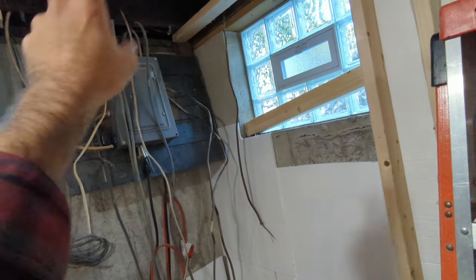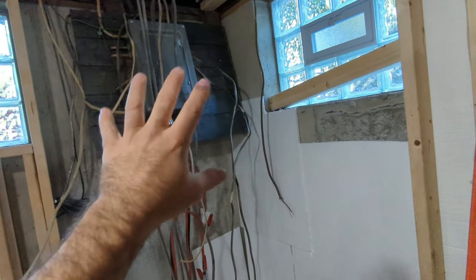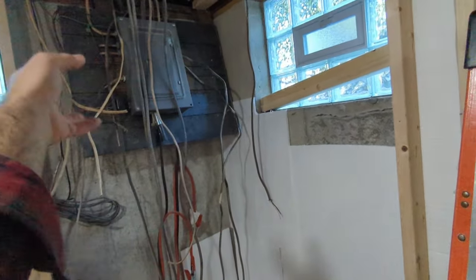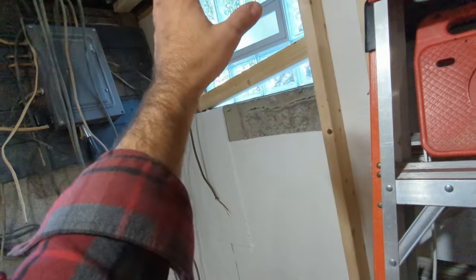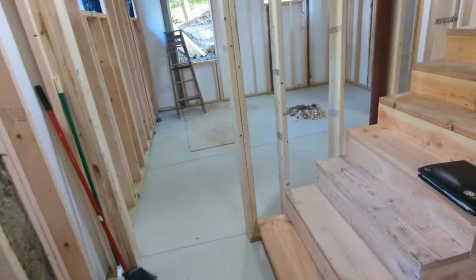And as soon as you have us disconnected at the street or take the meter away, they won't connect us back up until we've passed our electrical inspection, which means as soon as I need to move this, get everything disconnected, pull that panel down, finish framing and insulating, put a new panel in the wall, get the new service out to the meter, and put all the new circuitry and wiring and breakers and all that stuff in here, we'd have to do it with no lights, no radio, no battery charging, nothing. We wouldn't have power on the site.